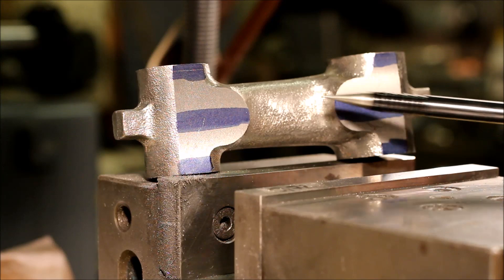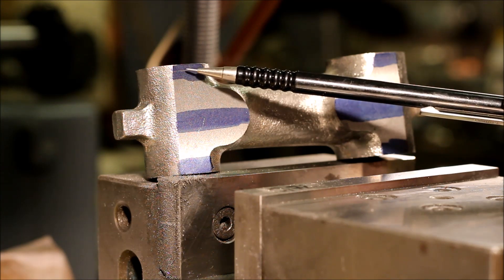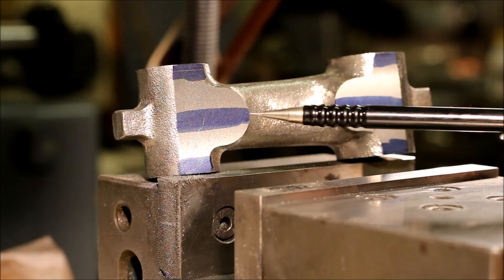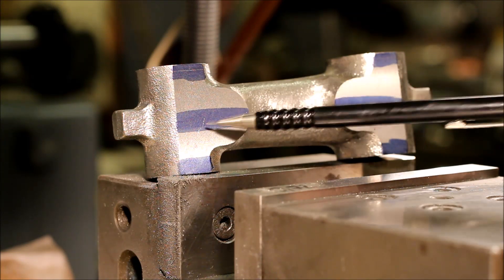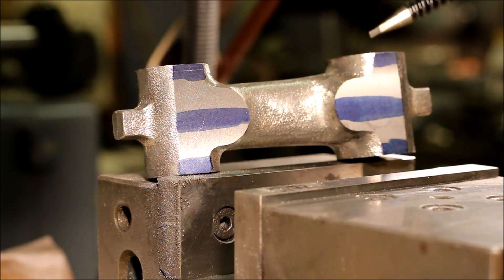I scribed a center line. From the center line it's three quarters of an inch up to the top of the part, so I have to mill away that piece. I do the same on all three pieces, turn them around and make them one and a half inch high. Next time I will drill the holes in this area on all three parts. We will make some brass pieces that should be located in here — we need them before we drill the holes through the arms where the pillar should be mounted. See you next time and thank you for watching.